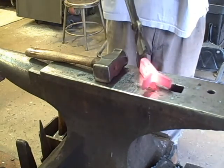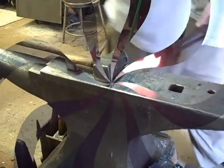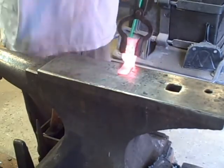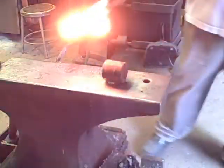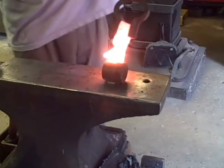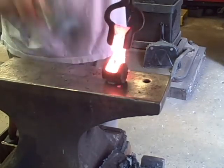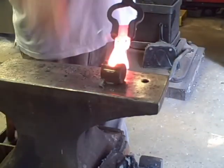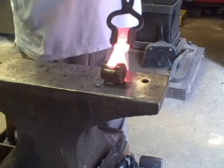You can see I've definitely made some progress there. We'll speed this segment up — you're not seeing all this forging, but you're seeing a good part of it. Next I have to essentially put a scarf on the ends for the welding. What I do is just thin the ends down to probably close to a thirty-second of an inch. I could have done that directly on the anvil, but I have that little round hardy tool so I used it — it keeps me from hitting the anvil directly with the hammer when I go that thin.